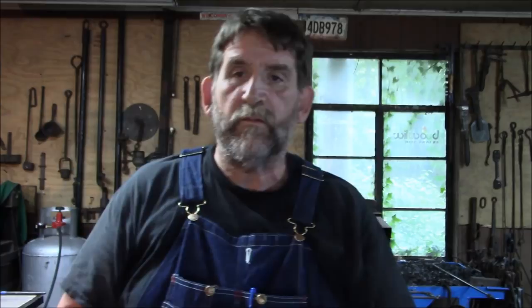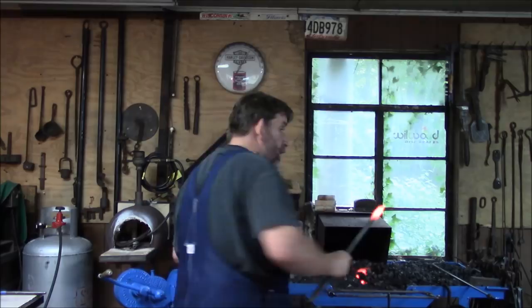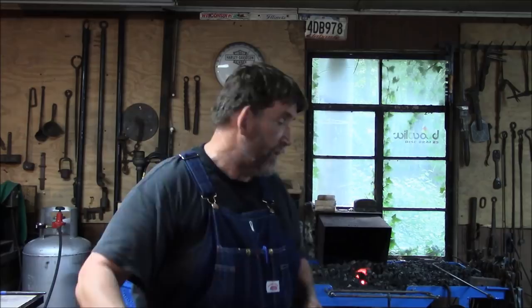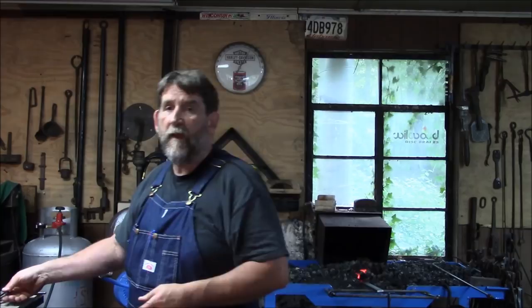Let's get started. He's made from one inch by quarter inch flat bar of mild steel — that's what we're going to make him out of. We're going to start out with a thirty inch long bar, mainly because that way we don't have to use tongs, and for those of you that are still kind of challenged by tongs it'll make it easier for you. So let's get this bar warmed up and get ready to start.